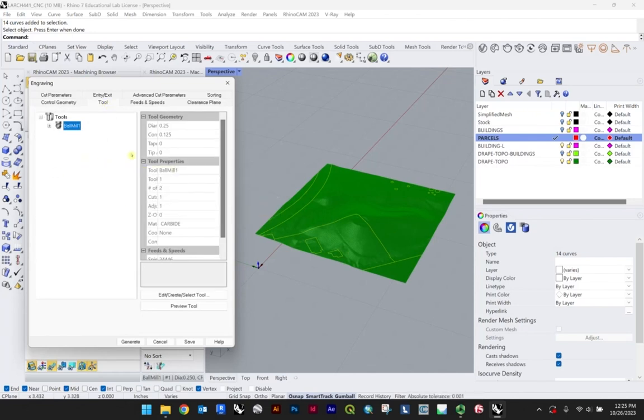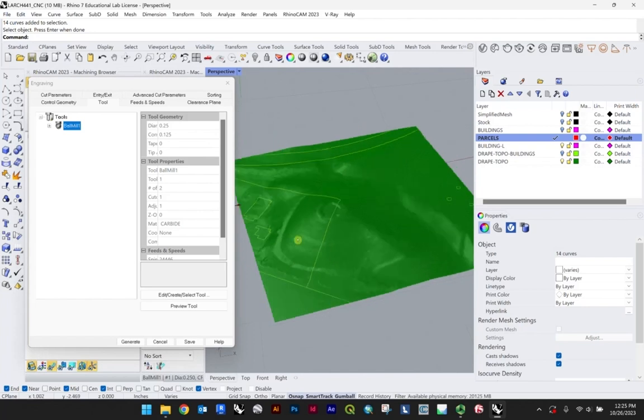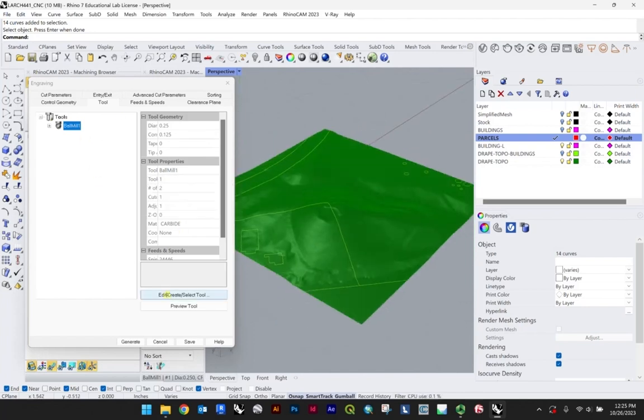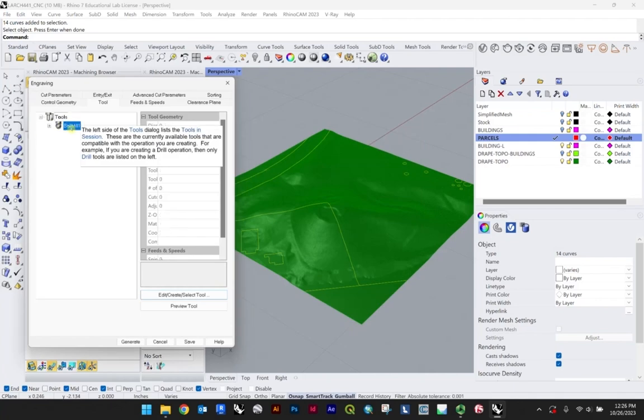Depending on what you're doing, you may want to edit your bit, and this will have to do with the lab, and if there's an appetite to change a bit for this, or if they believe you should just keep going with, in this case, this 1/4 inch ball bit. I'm not sure if they even have anything more fine than that, but of course the finer the better if you're trying to have just a delicate line, and you'll see what I mean. I'm just going to keep this, but in theory, if you made an additional ball mill 2 and you had something that was a finer diameter here, so if you look at that and we have it at like 1, something even thinner could potentially get you a nicer finish, but I'll just stick with ball mill 1. So again, just make sure you have that selected.